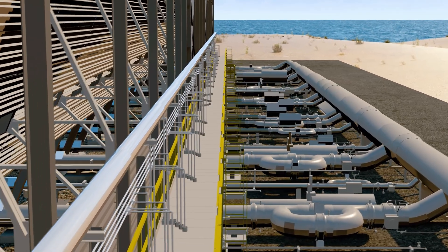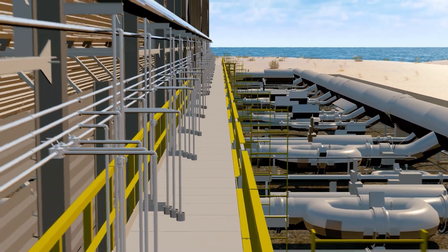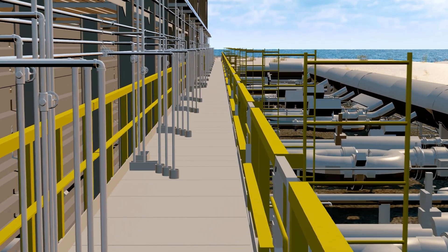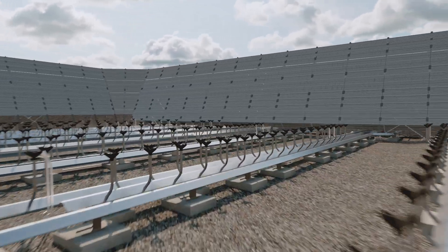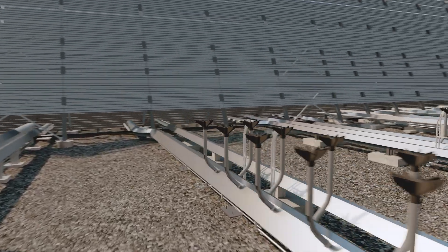On the outside are control systems and a large enclosure fence that surrounds the multi-point ground flare, protecting workers from heat radiation and reducing flame visibility. Inside are numerous rows of runners that are designed to handle varying volumes of flare gas.